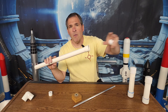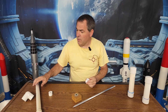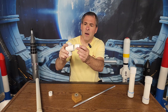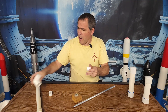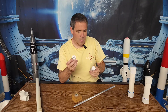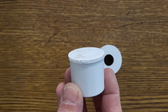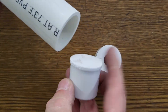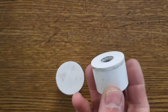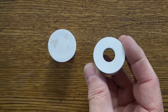Sometimes when you buy PVC pipe it has a bell at one end so you can join another piece without a coupler. This cap fits into the bell end and can also cap fittings such as tees, elbows, or couplings. The PVC cap has a small lip at one end, and we need this part to fit into the inch and a quarter PVC pipe of the motor. So I took that lip off, and now the part fits nicely. I also cut it down to exactly one inch long and made a half inch diameter hole in the end that fits the coring rod.